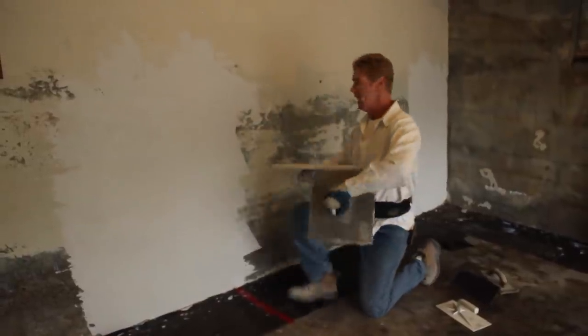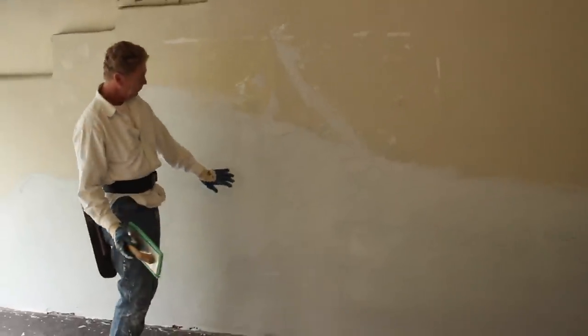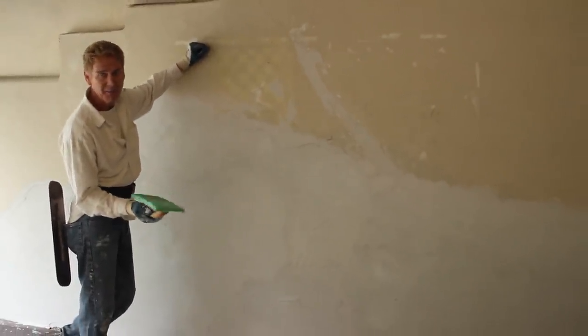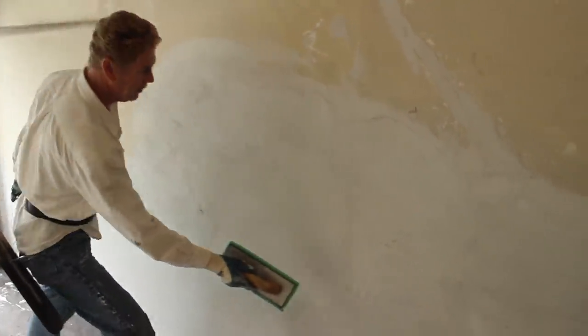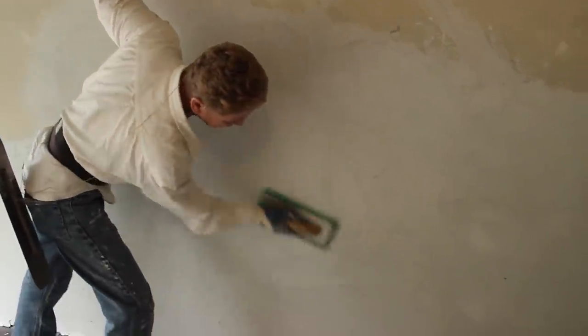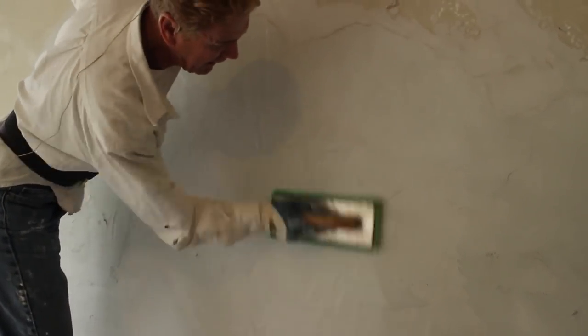This product, Imperial Base, sets in about half an hour. If you contaminate the mix you get about 10 minutes and it's set. Going over concrete we had about five minutes. The first batch is already set. I don't know if the camera can distinguish it, but one piece in here is really white and this is darker — when it dries it lightens up.